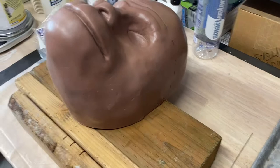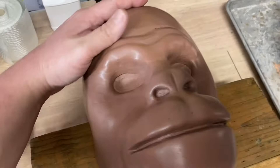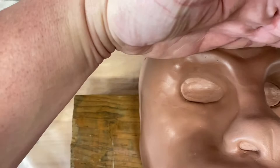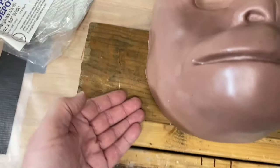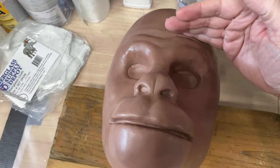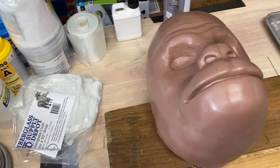The first thing, I think, is I've got to make sure that my sculpt is cleaned up. Now I'm only going to be molding, the mother mold only is the face. So there are some areas up here that aren't clean, and I'm not worried about that because I'm going to be doing a clay wall that comes up to about right here. It's going to extend all the way down and then come down flat around. There'll be a big heavy duty flange that comes all the way to here and then up around the forehead, and then it'll extend over to this other side, and come down this way and sit flat around this.